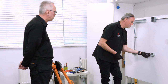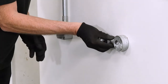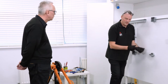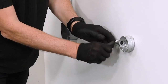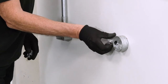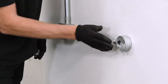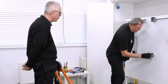The nipple goes inside the box. The thing you need to do here is have it approximately half and half. You don't want just a little bit there because it becomes a very weak spot, and you don't want to run it all the way in with just a little bit of thread exposed. Spin it and it should run nice and freely. If you haven't cut this properly, it will actually be eccentric when it goes on and may point into the board or out. It's got to be nice and square — roughly half and half.